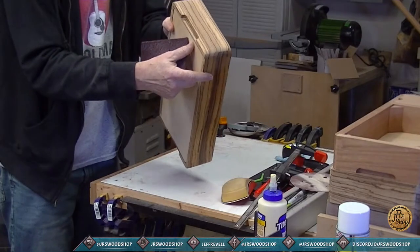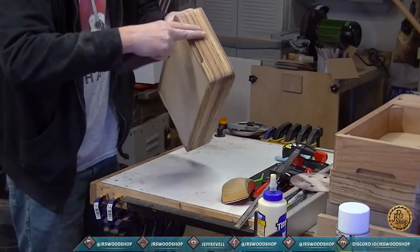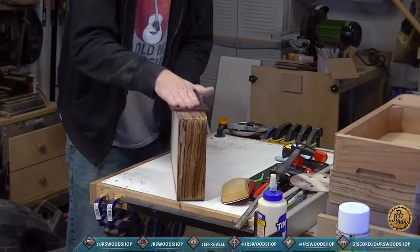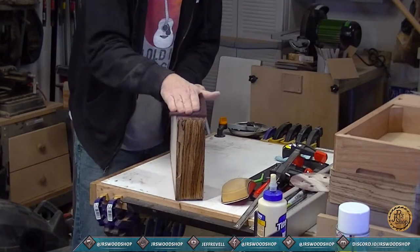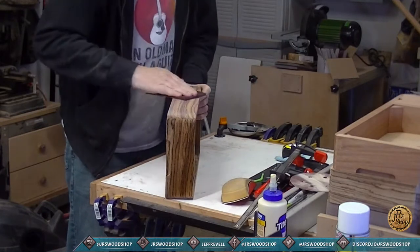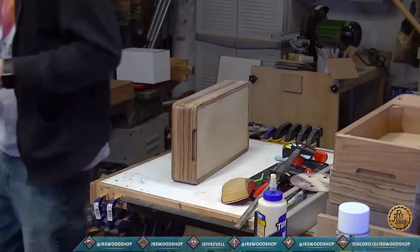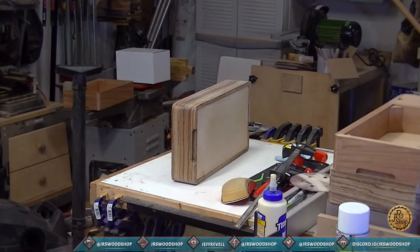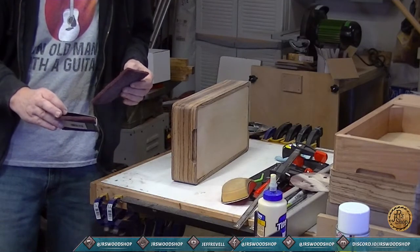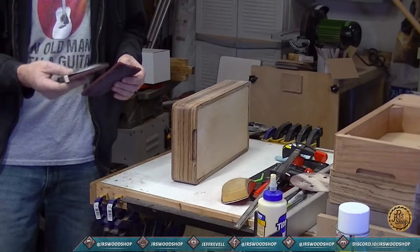And I'm just trying to look and see the surface. I'm trying to shine it in the light to make sure that it's all clean and satiny looking. If I see any glossy spots, those are areas that need to be hit with the sanding pad again. And these are pretty nice. These are the gray ones or whatever. Actually, I have these sitting here somewhere. Yeah. So this is a 3M very fine hand sanding pad. Removes residue and blemishes. I don't know if it tells an approximate.